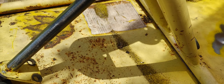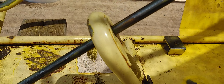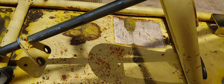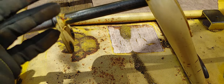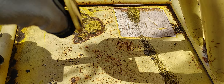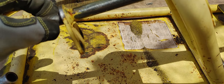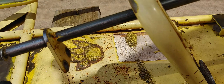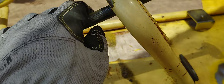I'm going to have to use the grinder to grind this bar off here to remove it completely. It's kind of silly the way they assembled these — there are no bearings whatsoever, just metal on metal, and they welded this part so there's no way to take it out unless you cut or grind it off. I'm going to do it properly with a bracket and a collared through-bolt so I can remove it next time if I need to.